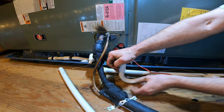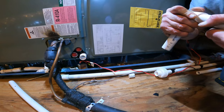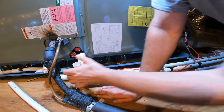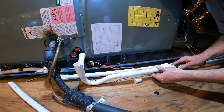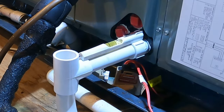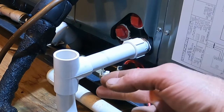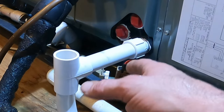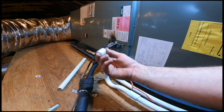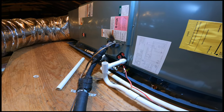I could always cut into the floor, which is actually what part of me is thinking about. From here to here that's pretty good. It's higher in the back than it is here — you always want to make sure your drain is going downhill at all times. I see drains that go uphill sometimes. The problem with that is water sits there and that section can get clogged up. Now that we have this pretty much done, this cap piece is too small — I'm going to have to cut a small piece, make a cap, and close it. But for now let's attach the pipe.